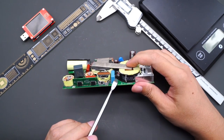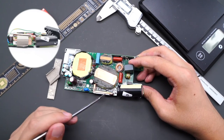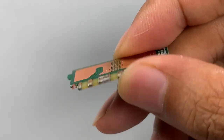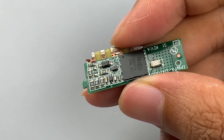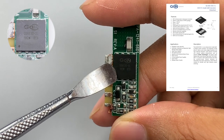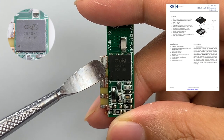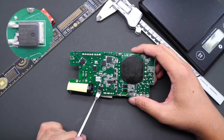The blue one is a resonant capacitor. On the other side, an electrolytic capacitor is placed horizontally, and a small PCB with heatsink is nearby to effectively control temperature. On that small PCB, there is a GaN FET rated 650V 50mΩ used for PFC boost. It comes from GaN Systems GS-065-030-2-L, an enhancement mode GaN on silicon power transistor with high current, high voltage breakdown, and high switching frequency, suitable for high power density products. The PFC boost rectifier diode comes from WIN BYV10ED-600P.